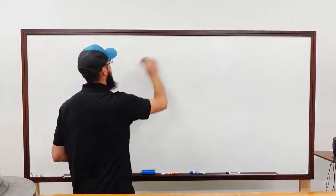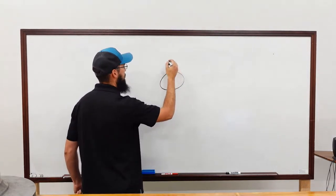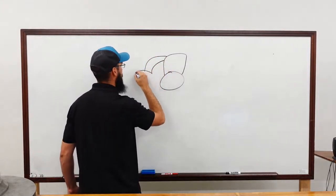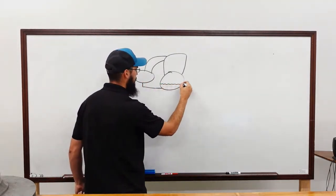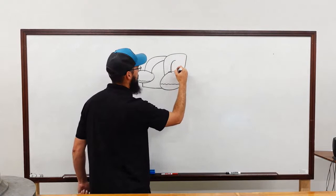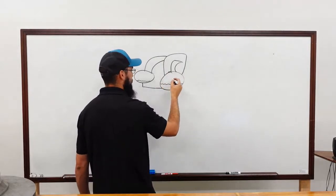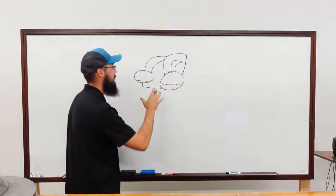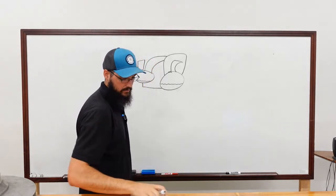As we've seen going through this, you've got your evaporator, your compressor, your volute coming into your condenser, liquid coming out, and we'll just say this is a flooded machine. And we have our suction elbow coming out from there. It's really as simple as that. Now, where Trane and low pressure machines become a little different is we have a purge assembly.